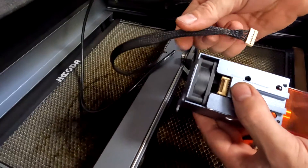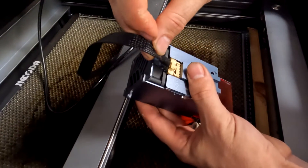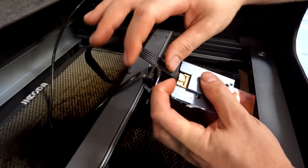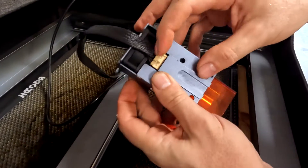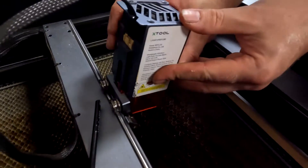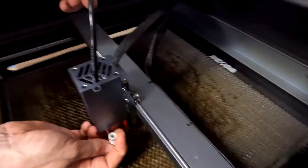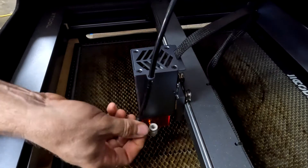The next step is opposite of what we did to take it off. Take this harness and plug it in — when you plug this in, make sure that little clip catches. You should hear it click. If not, just make sure it's pushed down and pull back up gently to make sure it doesn't pop right back off. Slide the harness back up through the little holder. Make sure you rotate the laser, check your wiring harness and make sure it's flat — you don't want to have that coiled up three or four times. Slide the laser back down the hole and tighten down the latch. The last thing I'm going to do is put my air hose back on for my air assist — this should just push back down through the holder and then back down into the hose. It doesn't click or lock in place, it just slides in.